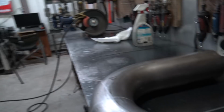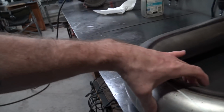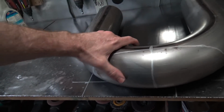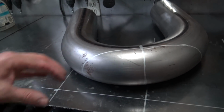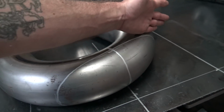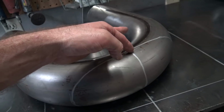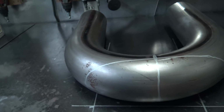that's showing kind of this knee here, and then cut it in half, and then you just basically fold them up and then weld them together. The easiest way to do this would be in a bandsaw. If you have a nice horizontal bandsaw, just cut that right off a little shallow of the line, and then you can just always clean it up on the belt sander, make sure it fits well.